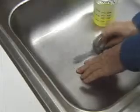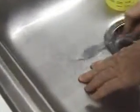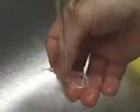A little soap aids in removing the excess unexposed resin. The base sheet is needed during this step to support the die so it's not damaged by scrubbing. The die is removed from the temporary base sheet, rinsed on both sides.